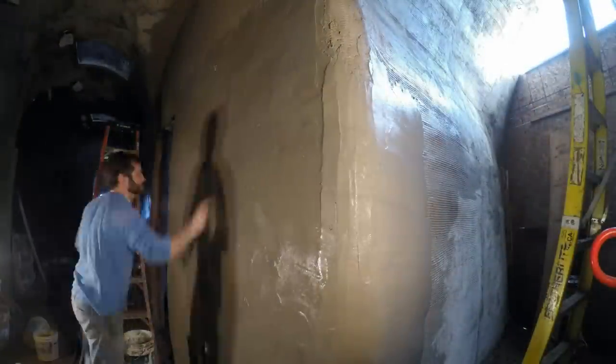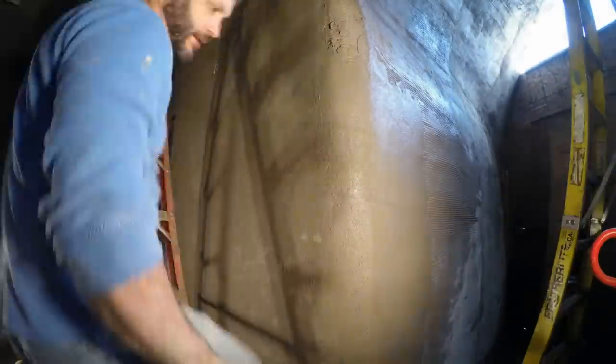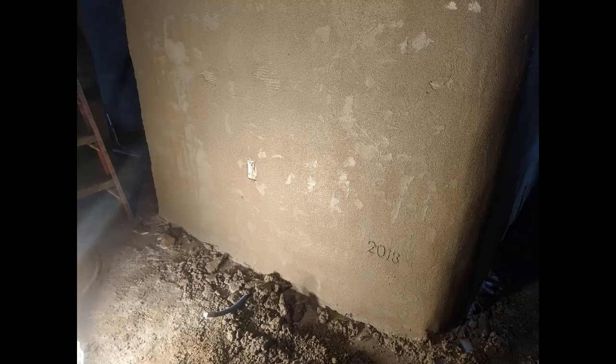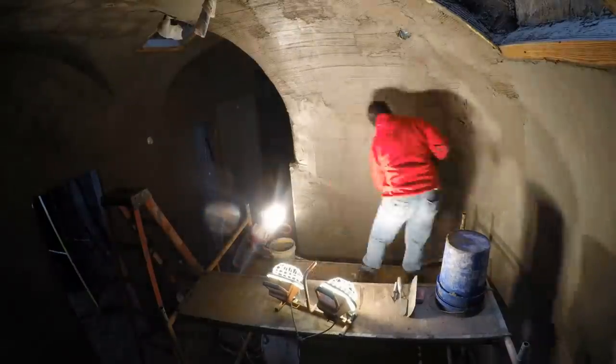On this wall I decided to try to rubber float it too soon, just within a few hours of putting up the stucco. You can see that the stucco was too soft, so I was getting patches where it was rubbing off the brown coat completely. It sounds bad but I actually kind of liked it better than anything we've done so far. So I carved a date into the bottom of this wall and decided to leave it that way. Still, I haven't figured out how to get the finish we want, but we had no choice but to press on.